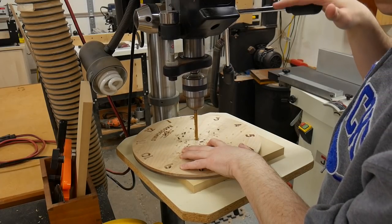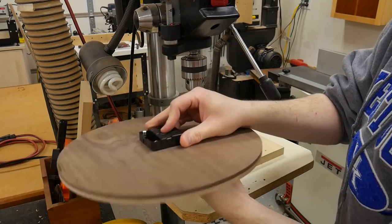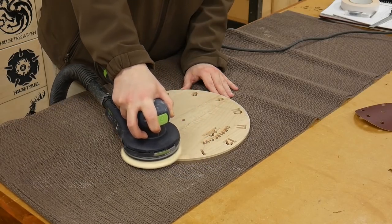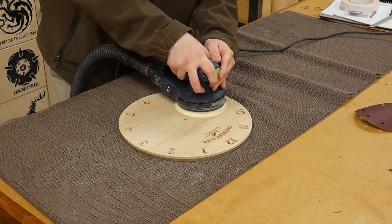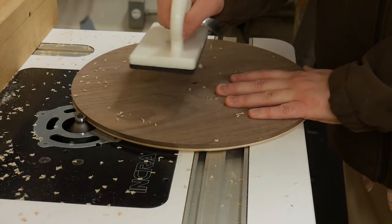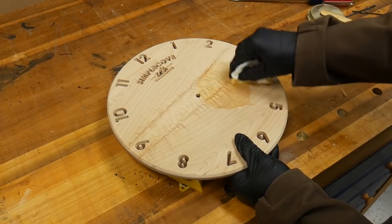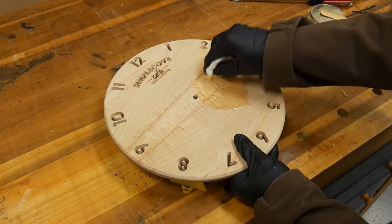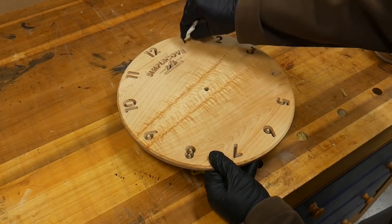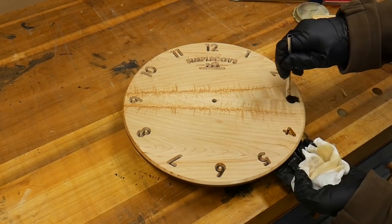I'm not sure why I used the drill press for this instead of the CNC machine, but I drilled a 5/16ths inch hole for the hardware. Even though this is a shop project, I'm still going to treat it like a piece of furniture, and that starts with sanding the surface up to 150 grit. Then I added a nice chamfer to the front side just to jazz it up a little bit before finishing it. I wiped an oil wax top coat on just using a cotton cloth, and I made sure to apply the finish very thin and only applied one coat to both sides. To get the finish down in the numbers and in the logo, I used an acid brush.